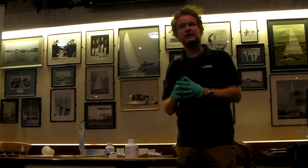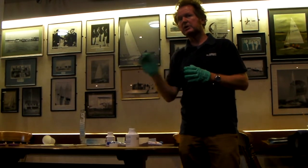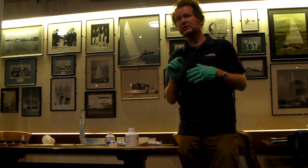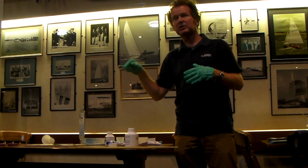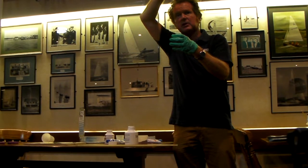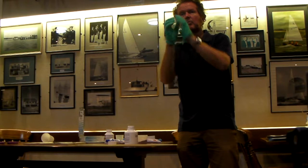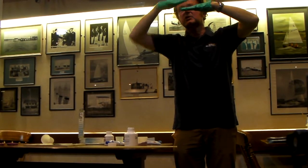I think there's a use for it in keels. Timber boat builders love using this with oak because oak has a lot of energy in it. At the boat show I had three enquiries from people who had sourced this material, because they'd read on a blog that it's very good for sealing the keel on a conventionally through-bolted keel arrangement, raking out all the sealant and replacing it with this. I recommended either putting it into a syringe and applying it, or using a piping bag to get it in. Going in against a horizontal surface means you wouldn't need to thicken it up.